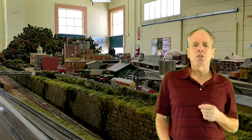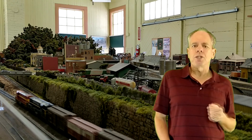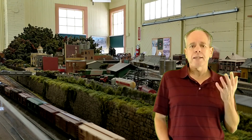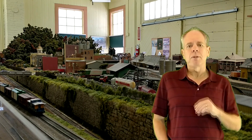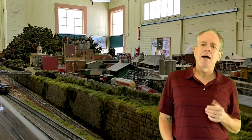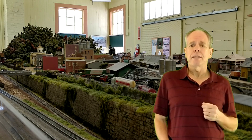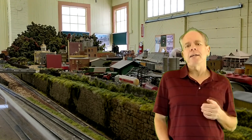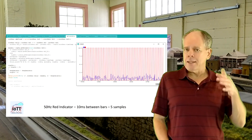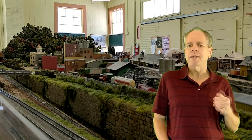Taking care of the signal noise needs to be addressed in the software, so it was time to make changes to the sketch. The first step was to make the sketch work with a constant sampling rate. During the initial tests I was sampling as fast as possible to find out how much data I could get from the IMU. I verified that about 1,000 readings per second are realistic, which is in line with the datasheet. So I changed the sketch for a constant 1 kHz sampling rate and added a grid output variable so I could see a timer grid in the plotter window and verify the effects of any filtering.